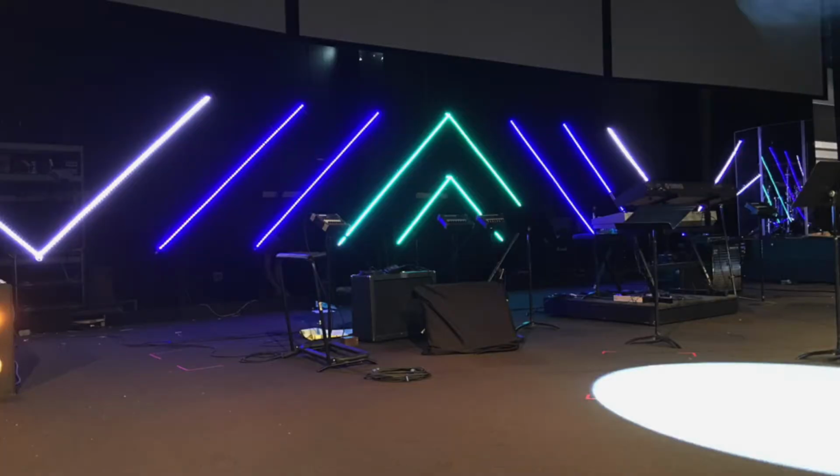So in our full set that you've seen in the previous video, and if you haven't seen it, the link will be below, in this full design we didn't have a single connection in our tape lights. We just used full tape light strips to go along one way, and then we tricked it, and we made just a loop in the same line, just one solid loop, and then we covered the top loop part, so then all you're seeing is the 90-degree angle. And we covered that loop with some plastic black tubing, just flexible wire tubing cover that we found around.